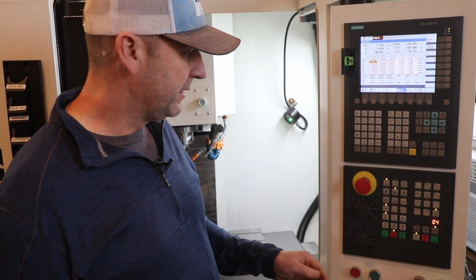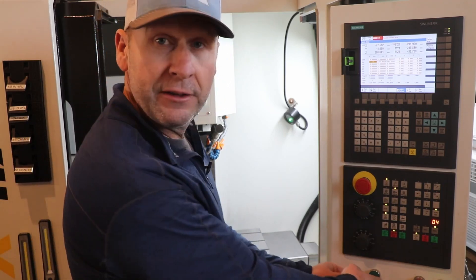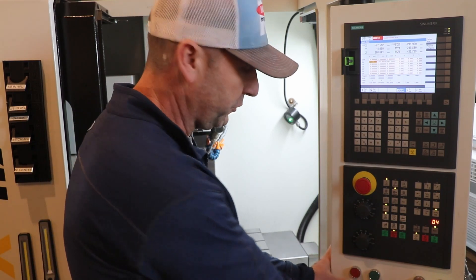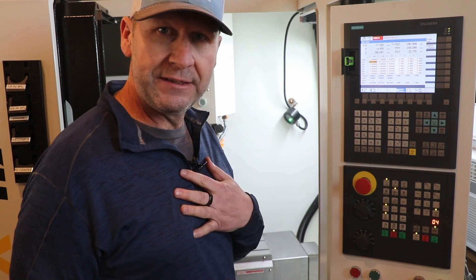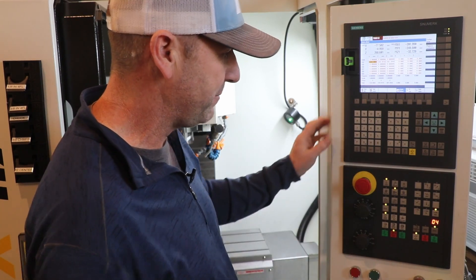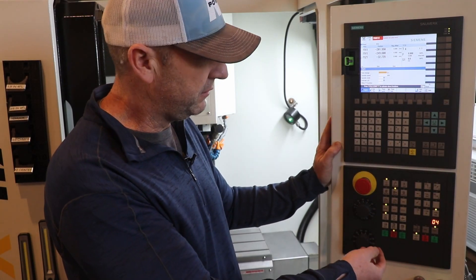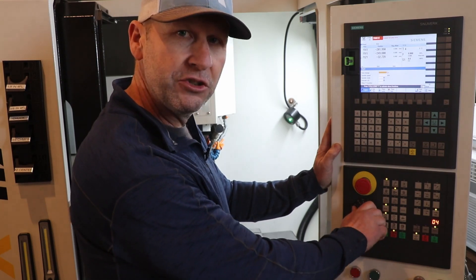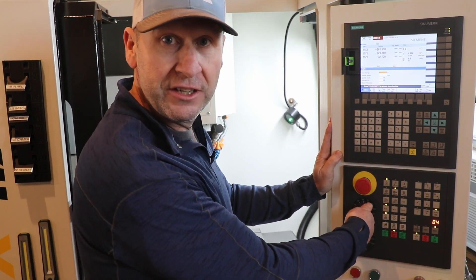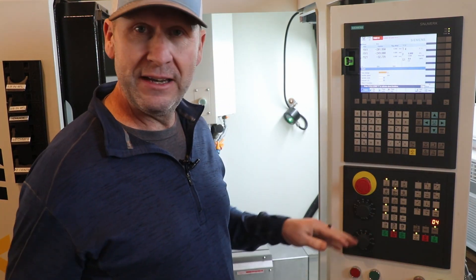But this time I'm not going to be complacent. If I'm confident with the program, I'll sit here ready to stop the program with the red stop button. Sometimes I'll even cycle through stop-start-stop-start-stop-start. But if I'm really stressing — the pucker factor's through the roof, which it will be this time since I know it's going to go near the vice — I will lower this feed rate knob. Once I make that tool change to my 3mm end mill, I'll lower this feed rate knob down to zero and control how fast that end mill is descending towards my vice. If it doesn't look good or I feel like I'm really close, I'll throw this to zero, hit stop, and end the program.